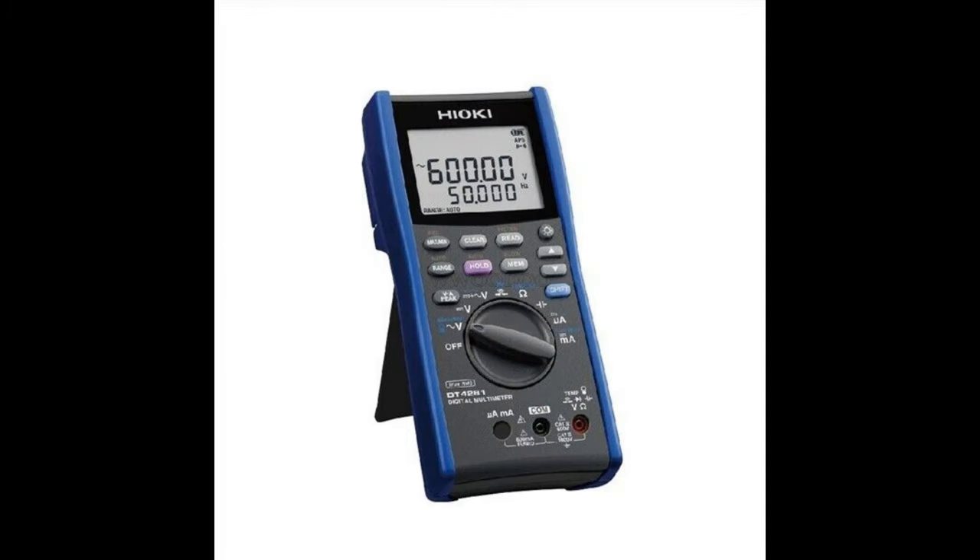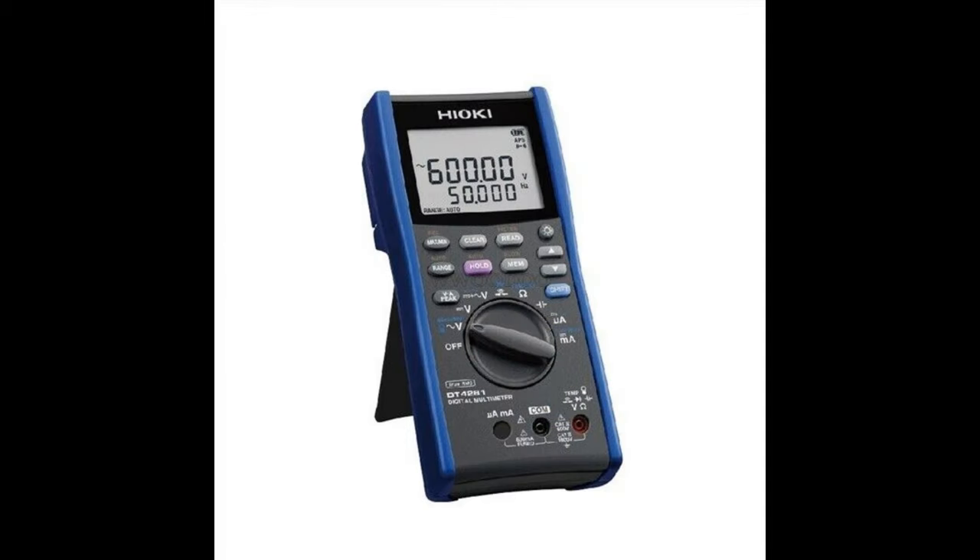But to do so you would need much more precise temperature measurement. The counts number is a key parameter in electronic test equipment. Broadly, every time you add a naught to the counts, you also add a naught to the price. For example, digital multimeters costing ten to thirty dollars have counts of between about four and six thousand, meaning full range deflection is covered by six thousand discrete steps. A fancier meter with a count of fifty thousand is likely to cost about five hundred dollars, and a really high precision one with a count of over a million will cost two thousand dollars or more. The same relationship between counts and price is seen in digital thermometers, weighing scales, etc.